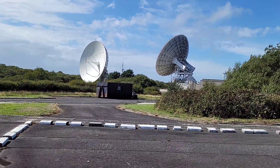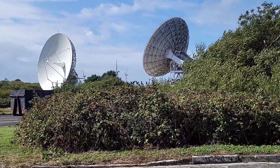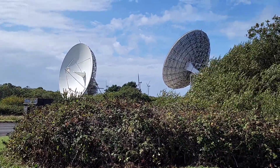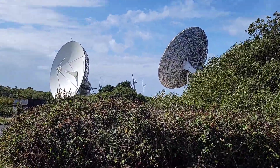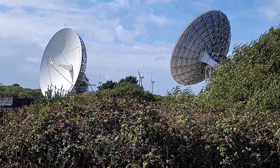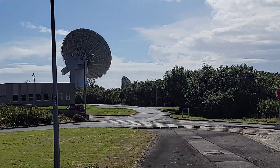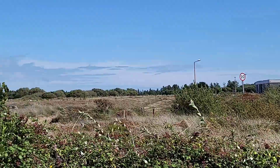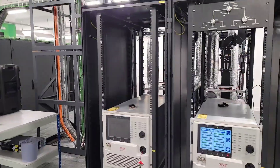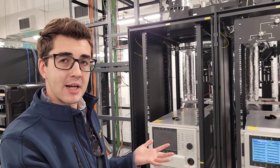When we started looking at the complex, if you haven't seen the details from the previous video, please go back and check it out — it's linked in the description. What we have in front of us is our S-band high-power amplifiers. We have two: we'll nominally use one on an uplink, but we'll have the second as a hot-backup ready to go in case of an anomaly, and we can switch between them.